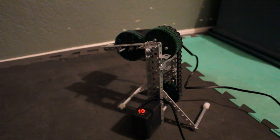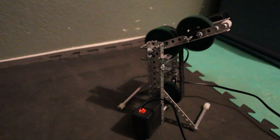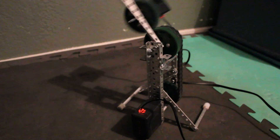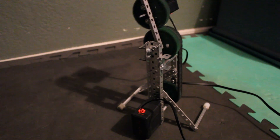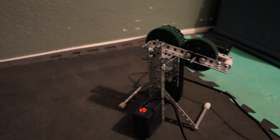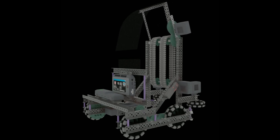Here is an example that I built. You can see that when both motors spin at the same speed, the bar stays in the same position. But when I speed up one side, the bar moves over to the other side. I can then stop it by moving both motors back at the same speed, or move over to the other side, and so on. This type of differential could be used for a moving hood, such as one where you want to angle the shot from a flywheel, or let the ball out of the system entirely. Here is an example more relevant to this season — the hood can change angles depending on if you want to shoot the ball into the goal or let the ball out the back.